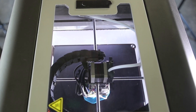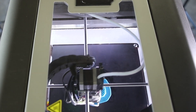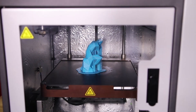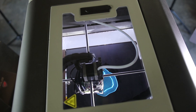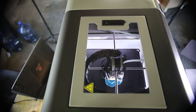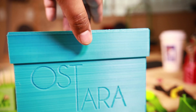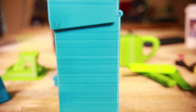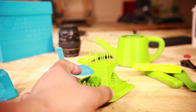Let's get to the mechanics. The mechanical components consist of a Cartesian array of smooth rods and LM-UU bearings, moving the effector carriage to a maximum of 260 millimeters on each the X and Y axis. The Z axis is comprised of the same max depth of 260 millimeters using a lead screw. The components are very sturdy and offer rigid, robust movement with minimal backlash. There was an issue I experienced when printing my Copic marker holder — banding caused by a loose fan shroud. I removed the safety cage from around the hot end and forgot to tighten the screws. I did not get this issue with any of my other prints.